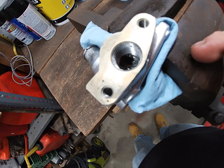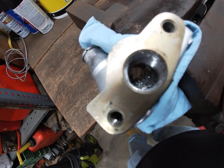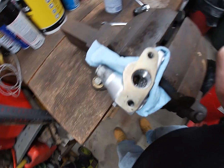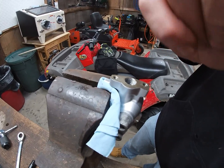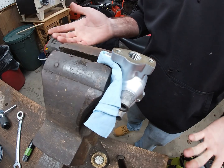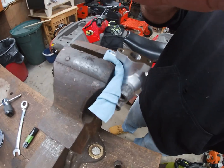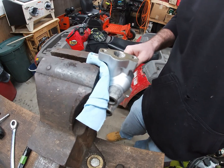As you can see there's a ton of metal shavings and debris in there that you want to blow out. If you have an air compressor you can spray it out with some carb cleaner or whatever — you just want to make sure this is really clean before you put it back in. It did a fantastic job of putting the threads in there.